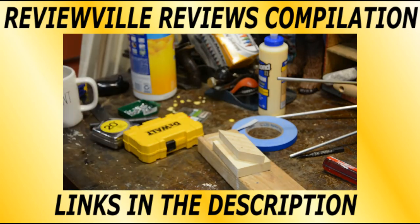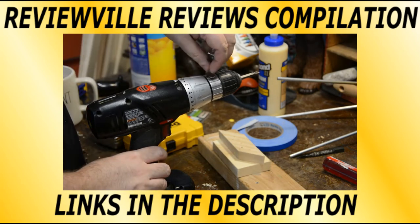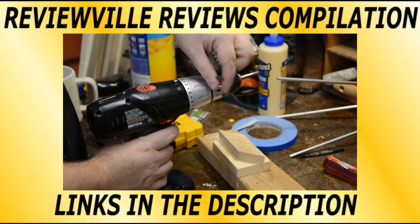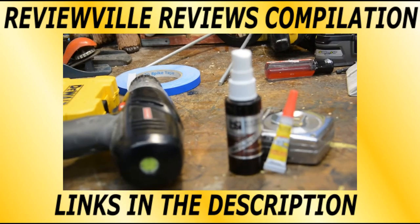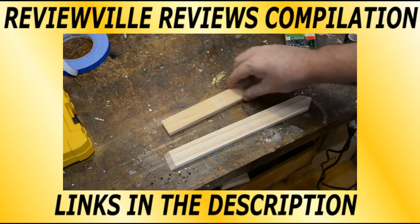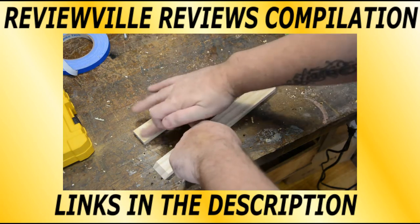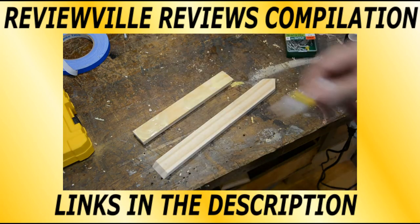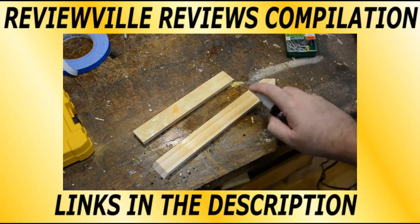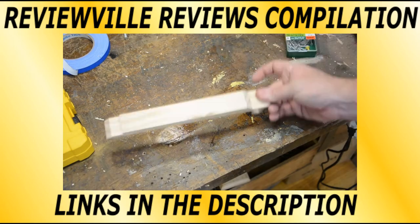Often when you're hanging something on the wall, you need a free hand to hold whatever it is you're putting up. So instead of having all the screws in your hands, you can put a magnet on your drill to hold all of those screws for you. And it works great. Number six deals with my favorite workshop duo: CA glue and activator, also known as crazy glue and the stuff that makes it stick really fast. Whenever you're using wood glue and putting two pieces together but don't want to wait to clamp and let it dry, you can use CA glue and activator to temporarily hold the wood, giving the wood glue time to dry while allowing you to get on with your project.